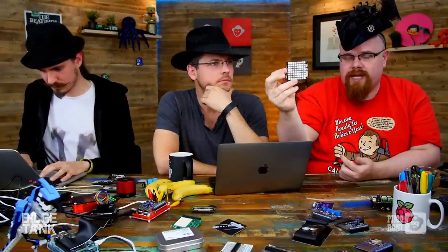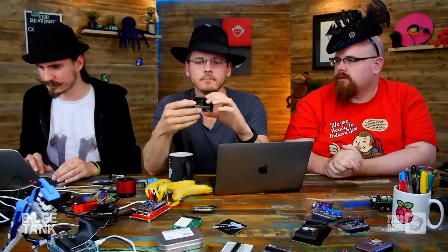Sorry, WS2812Bs. Sorry, trademark. So that was our test card. It works pretty well, and it's bright. One week we might just try frying an egg on that when it's at full brightness, just to prove it can be done, because we think it gets warm enough. If you put all of the LEDs on at full brightness, it will draw about 1.2 amps or so, just within the threshold of what the Pi can give it.